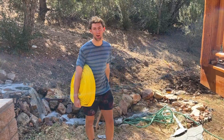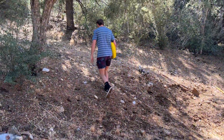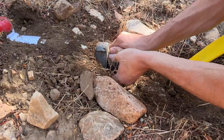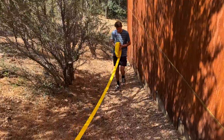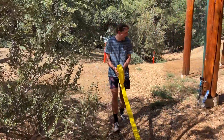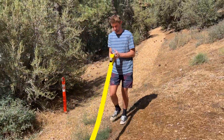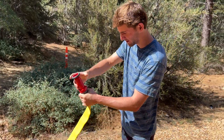The fire sprinklers have been running down there, but let's say the spot fires are still advancing. We're going to take our fire hose and get it hooked up to our pond right here. This is an inch-and-a-half booster line and it just connects right here. We're going to want to lay this hose out all the way down there flat before we put any water in it — it's important to keep it flat and not kinked. If you put water in it while it's kinked, you've got a big issue. We'll unroll it as far as we need and take our nozzle — hose is made in America, nozzle could use some work.